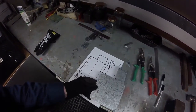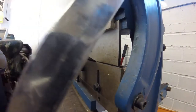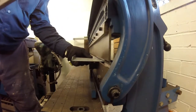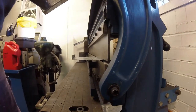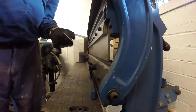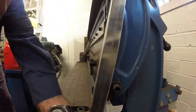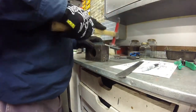With the development of the cover now correct, I'm using the press brake to bend it into shape. My apologies for the camera position here — I forgot to take into account the motion of the levers against the camera. My press brake has removable sections to enable it to do perpendicular bends, but for a quick job like this I just return to the bench and bend the top cover over manually.